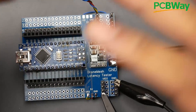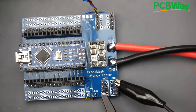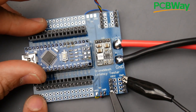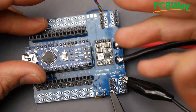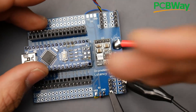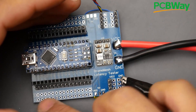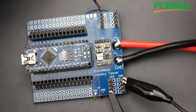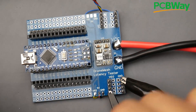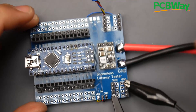This serves as more than one thing. One issue I often have is providing 5 volts because I run out of USB ports, and this is a great way to solve that. Look how many 5 volt and ground pins I have here. It's not going to handle a lot of current with this regulator, but it should get the job done if I need to power up a receiver or camera to double check it. I left the extra pads blank since I'm not currently in need of them.